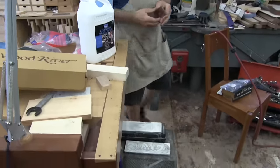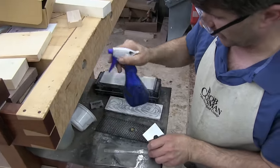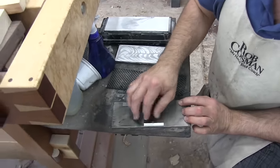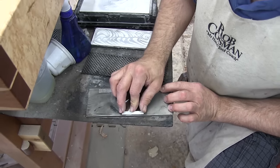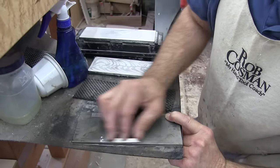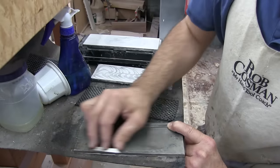We're going to do the standard sharpening on that, which means even with the bevel down we're going to introduce the back bevel. So with the steel rule on the edge of the 1,000-grit stone, set that on the opposite edge. Stay within a quarter of an inch of the edge. Three fingers to distribute the pressure as evenly as possible. I grab that corner and that corner with my other fingers, and put this part into the meaty part of my palm just to help steer it. I prefer to go forward and back — light to moderate downward pressure. You don't have to push excessively hard; let the diamond do the cutting.